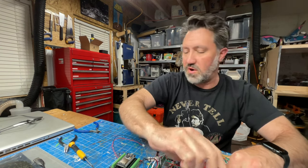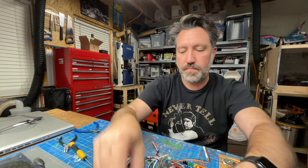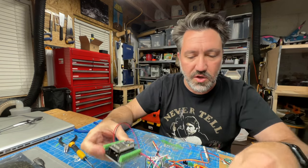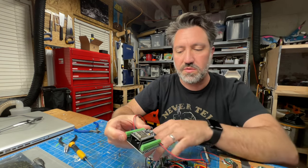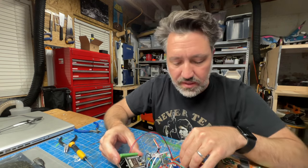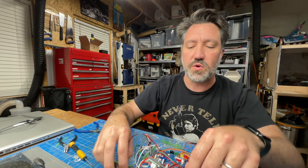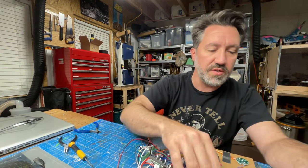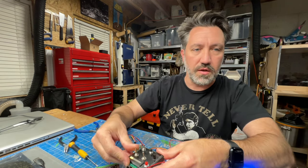I'm going to unplug a prior connection that I had in each of those. Notice that's all we have — no lights, no other devices, just power — and we're going to plug the power into the 5V out. Meanwhile the data serial connection is going to plug into the RX1 TX1. Don't worry, this will all be in a diagram in the documentation, but I just wanted the video to show what it looks like. I'm going to turn my battery on and turn on the wand.